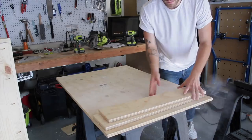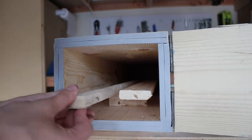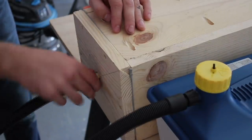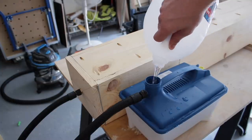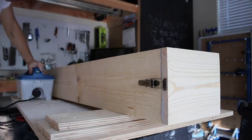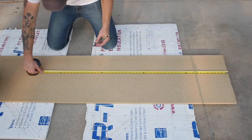We all know that heat rises, so we want to make sure and tilt the box so the steam goes from the back of the box forward to the front. I just threw it on a couple pieces of scrap plywood. Then I loaded up some pine 1x3s and 1x2s for my first round of steaming. This Rockler steam bending kit could not be more simple — there's a single hose that connects the steamer to the box. Fill the reservoir up with water and turn it on. As a rule of thumb, you want your box over 200 degrees and let your board steam for one hour for every inch of thickness. A really convenient way to measure that is to drill a quick hole and insert a meat thermometer into the top of your box. My box was a little bit oversized and I was only able to get it to about 190 degrees.